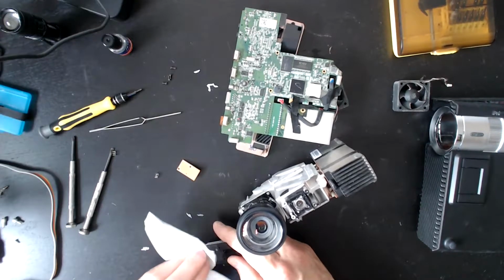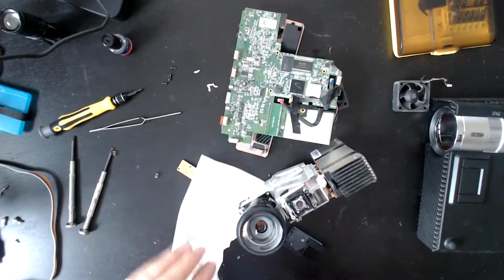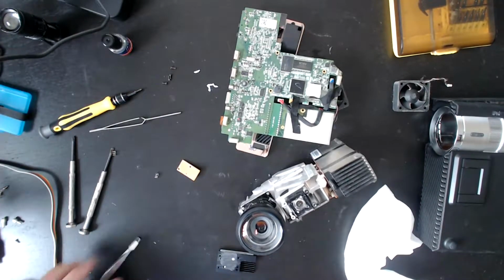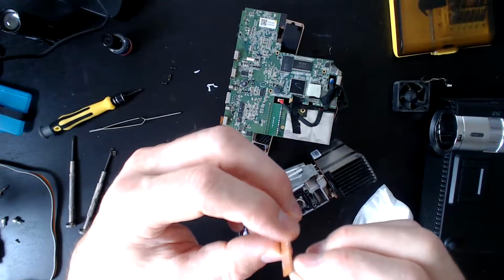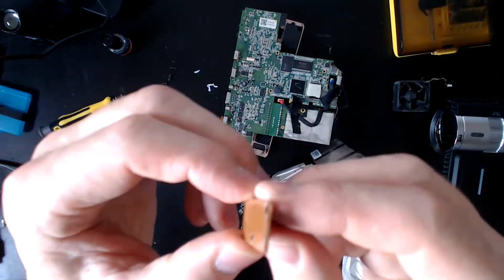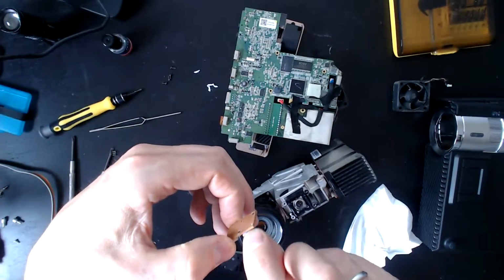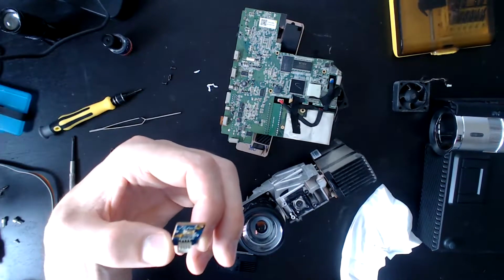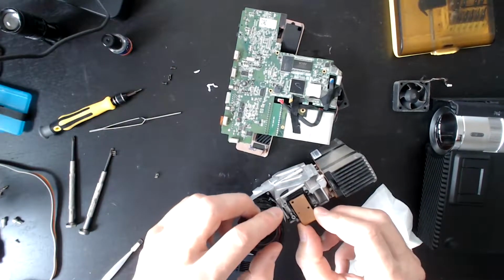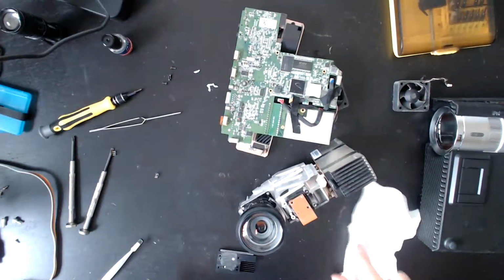The other thing I'm curious about is how did they do this PCB so that it would conduct the heat well enough to be effective? As far as I can tell, it is not the same as, oh, look at that. You can actually see it here. I'm not sure if it's coming through on the camera. Possibly not, no. It's basically two layers. We've got one giant side of copper and then a very, very thin PCB on top of that. That makes sense. Cool.